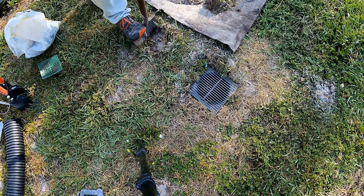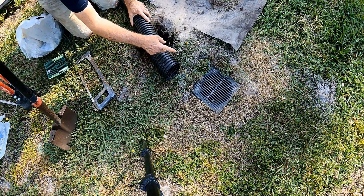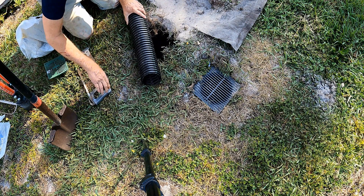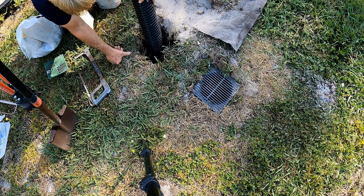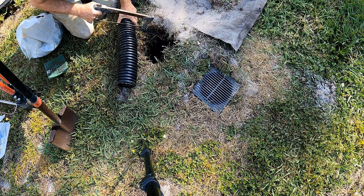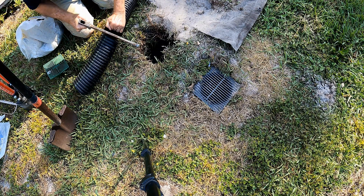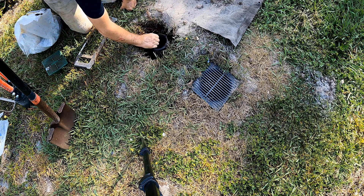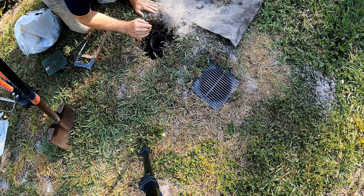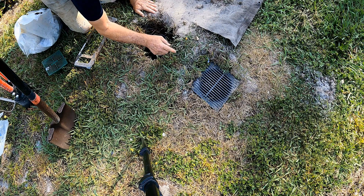This has got to be one of the best DIY projects for everyone, especially seniors. Just like with that Bachman tile, the soil has sloughed all the way around the pipe. We're going to measure it down and cut that off to grade. We're right at the top of the hard pan and I broke through a little bit. We're going to have a vertical shaft going down into the hard pan, and now I'm going to surround this with gravel and put another grate on the top.